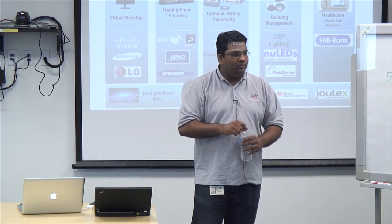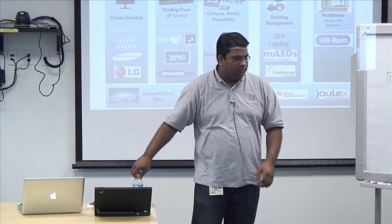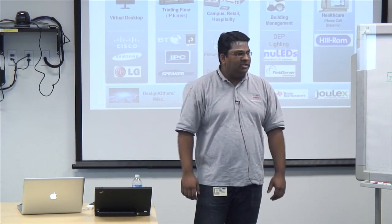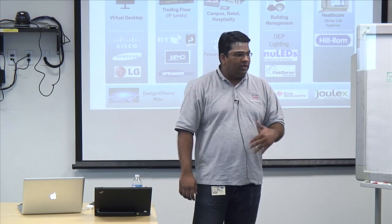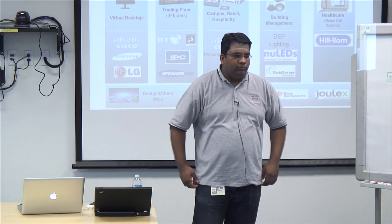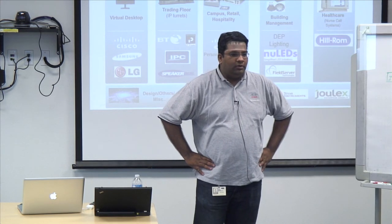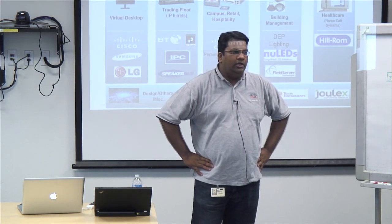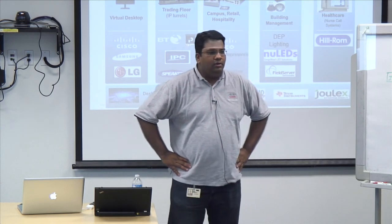So you can actually power a UC60 or EX60 off that? EX60, yes. EX60 is 48 watts. The initial start is 50, then it goes back to 48. How much power can the chassis deliver to one slot? 1500 watts, so that's 24 ports of UPOE per slot, and 190 ports maximum today on a chassis.